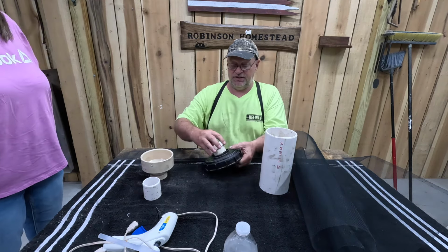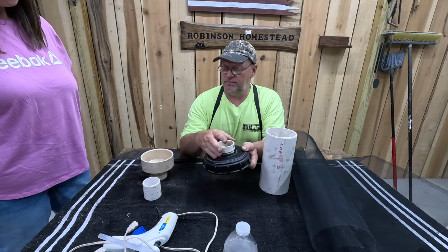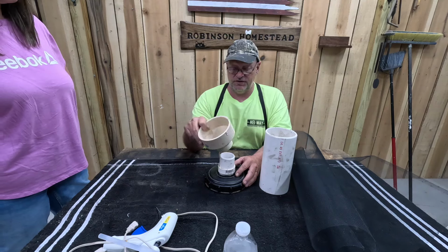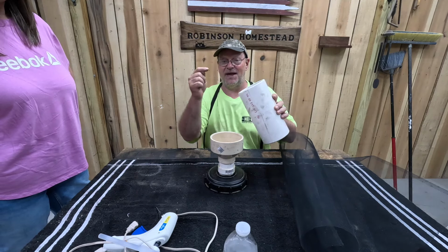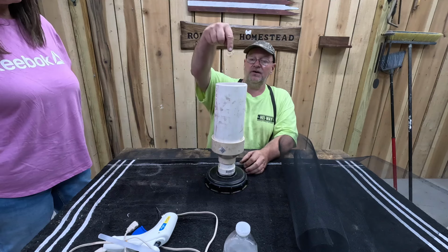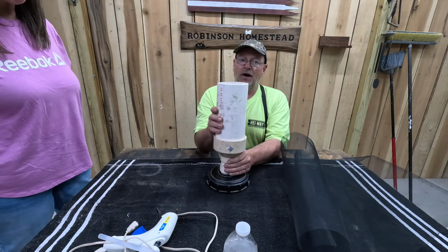But this piece here, this 2-inch piece, this is the male 2-inch, will screw into this, like so. And then I cut off a small piece of 2-inch pipe. This will go in here. Then this is a reducer from 4 to 2. We'll go in here, and then we're going to build our filter for the inside of this, but we have to be able to take the filter out and put it back in because we need to clean the garbage out of the inside of it. And this will go down on top of here, and our filter will be in here, and we're going to try to get all of our drain pipes to go into this one hole. Hopefully we can get this to work. But right now, I need to build this filter.